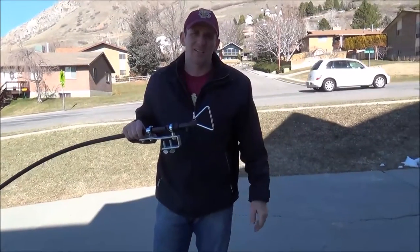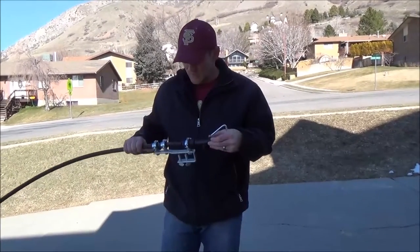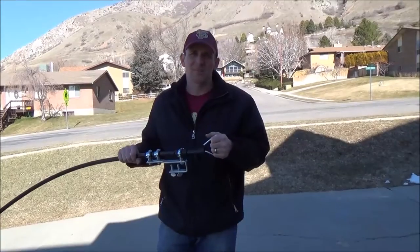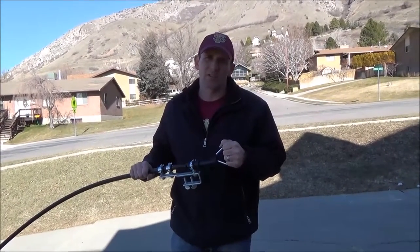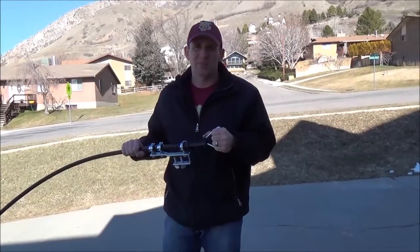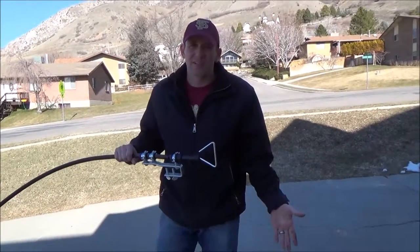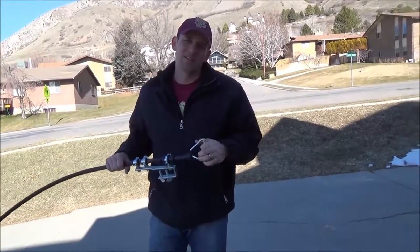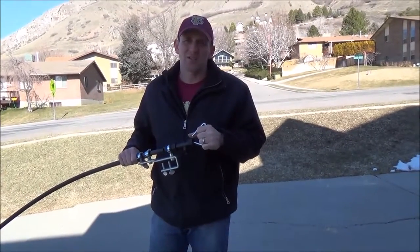It's good to go, and that's it. It's really easy — you can shorten your pump to whatever length you want it to be. The reasons you might want to do that: you may be hitting stuff in your well, or you may have piping. Just make sure you're well into the water so you don't have seasonal shortages if the water table fluctuates. Try and pick a length that makes sense for you. The shorter your pump is, the better your performance — the more gallons it'll pump and the easier it is to pump. If you're hitting water at 20 feet, you might want to shorten it up and enjoy being able to pump with one finger instead of putting 100 feet of effort into it. Email us if you have any questions. That's how you shorten your pump — thank you.